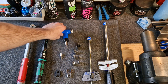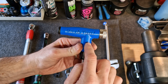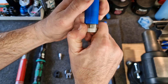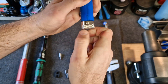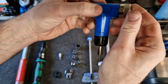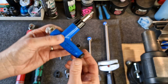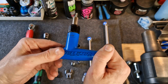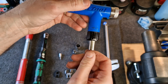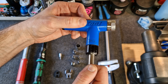The next type of torque wrench is a little mini one. Sometimes these come in preset torque settings — Park makes a 4, 5, and a 6. This one actually has a little dial on the top, so I can spin it round and set it to, for example, 5.5 Newton meters or 5 Newton meters. It has a bit that goes in the end, and this particular tool comes with a handy little storage compartment for a few commonly used bits. When you reach your desired torque, this one gives you a click to tell you that you've got there — that's how the feedback works.